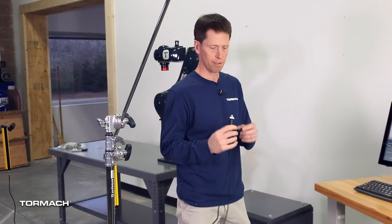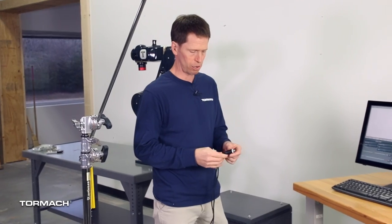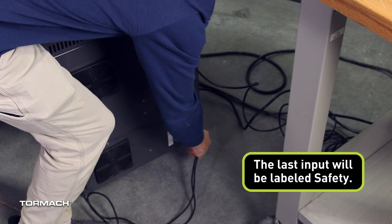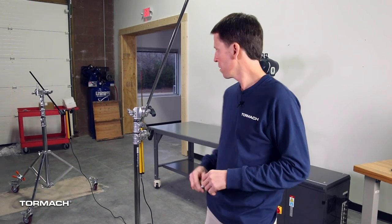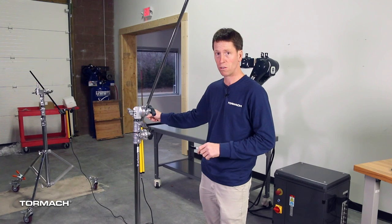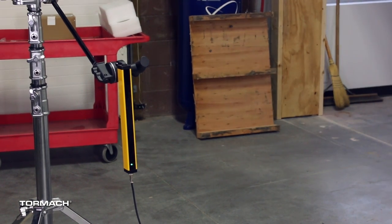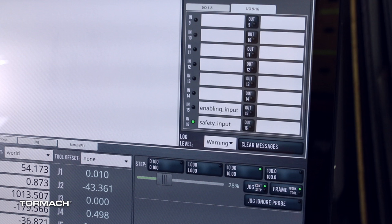This is an M12 connector — these connectors are five-pin connectors. This center threaded piece will rotate as the pins stay stationary. All the robot's digital inputs and outputs go through M12 connectors. The safety input goes to the last input in the electrical cabinet. We've got our light curtain set up and it's plugged into the safety input on the robot. You can check it by seeing a green light on the light curtain transceiver — when I pass my hand in front of it, that green light turns to red. The other way we can tell the safety input is wired in and working correctly is that the last input is showing a green LED in our software.